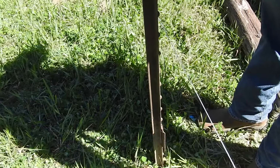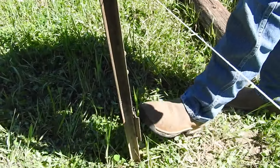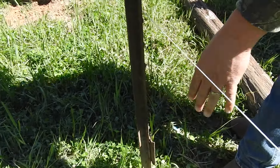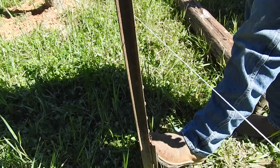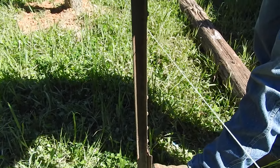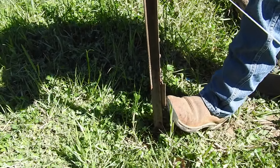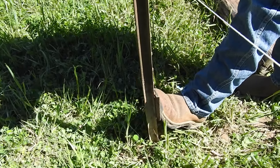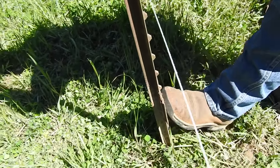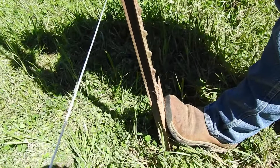Okay, and now when your foot is able to touch here — if you see the T-post twisting any which way and you want to try to keep it straight, just put pressure on this side or a little pressure on this side. Hold your tension with your T-post driver so it doesn't slide backwards. Don't put your shoe up underneath the thing that's going to go on the ground — just put your toes on your boot. Properly use a boot, not sneakers.